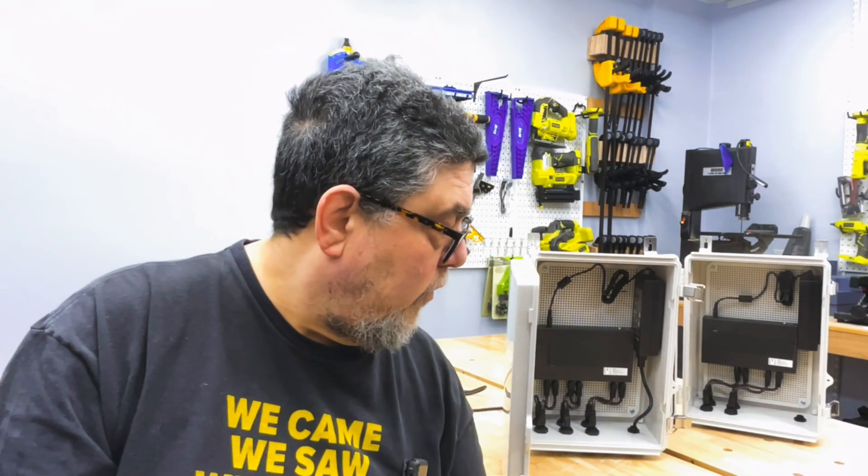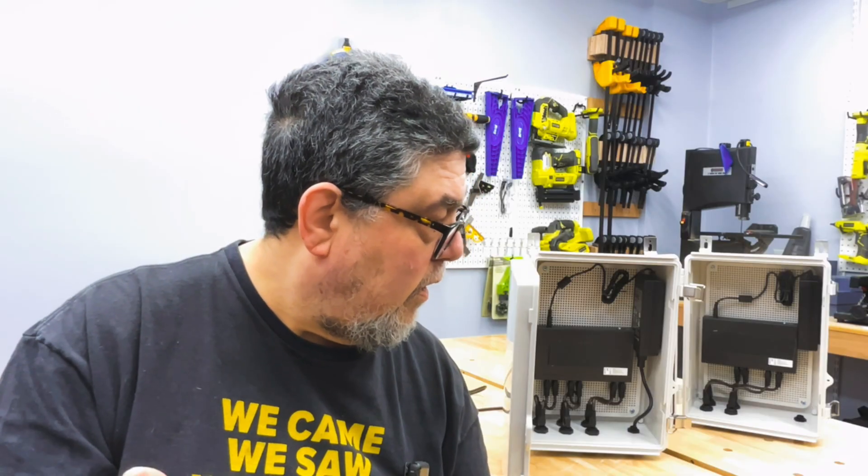This is all part of my revamping of my outdoor security camera system. My previous version used Power Over Ethernet, but stuck them in little boxes I dumped onto the ground, and dirt and crap grew all over them and made it impossible to maintain. So this time I'm doing a redo, and I'm going to mount these things on the wall. I have one already up and working, and these are the next two that are going to be able to distribute another 10 feeds. Technically, there's seven cameras going in here and three repeaters, so it'll come from one feed into the PoE box, from that feed to the next PoE box, and then the rest will be camera feeds. So there'll be another seven camera feeds in addition to the four I've already got up and running.